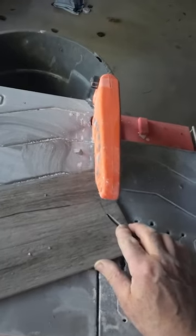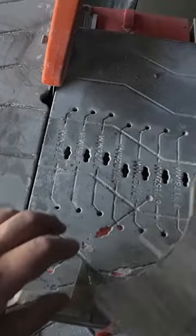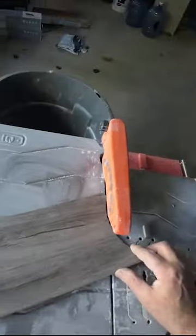So if you're using a wet saw, make sure that you dry the tile before you set it into the thinset — or better still, cut the tile dry. One option for cutting dry is a snap cutter, but that's only for straight cuts.